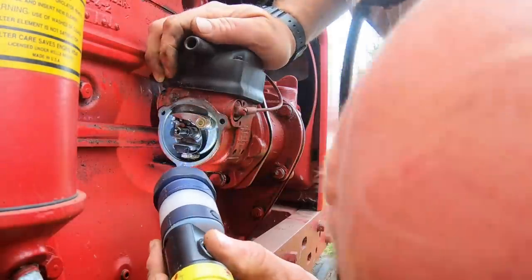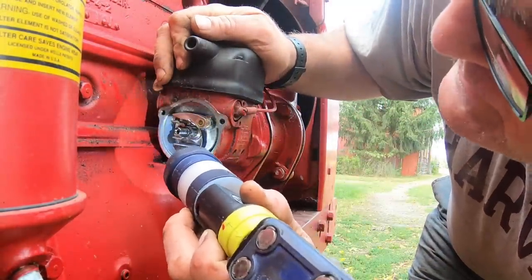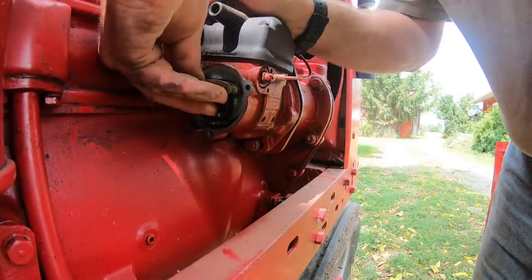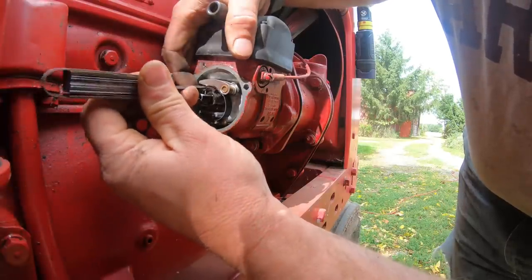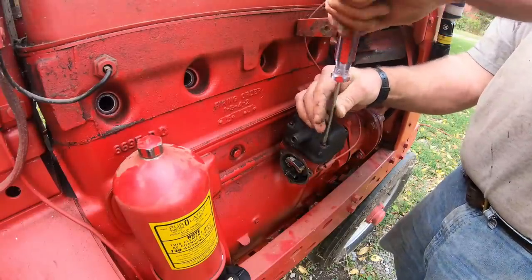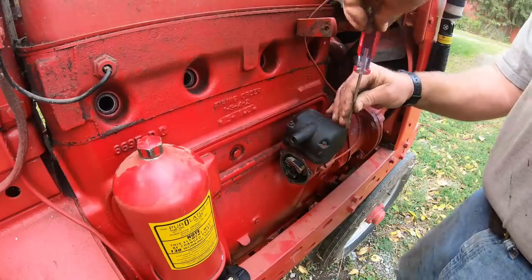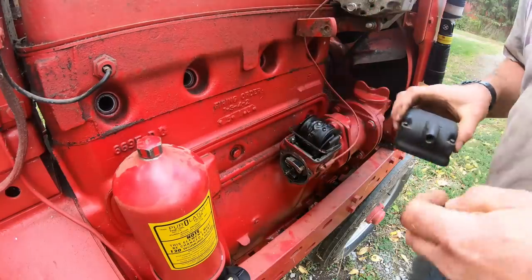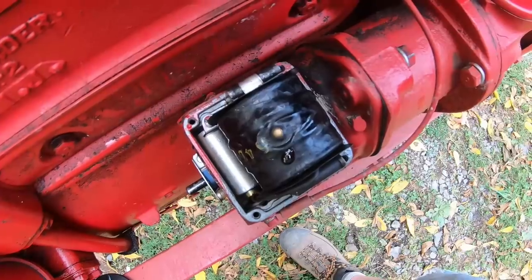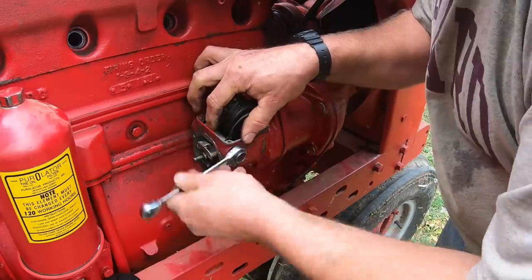I took a look at the points. These are the usual culprits when a mag won't fire, but they seemed fine. When I turn the tractor over, I still don't see a spark jumping the points as the engine turns. So I polished the points and adjusted the gap. Still no spark when I turn it over. I'm working backwards, really — from the periphery of the magneto into its heart. I started with the plug, which is at the end of its sort of spark journey, and then back to the points, which are kind of the next step in. Still no spark.